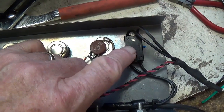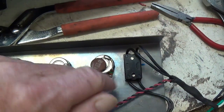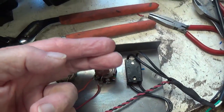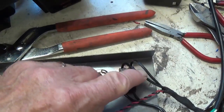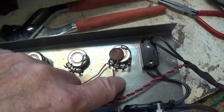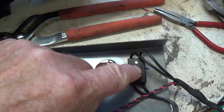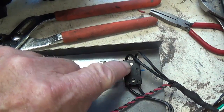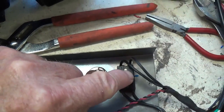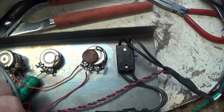And if yours isn't, then what you think is the white wire that is the return is going to become the hot wire because of the reversal within the receptacle on your wall. And the hot wire is going to be going hardwired into the power transformer primary. Not a good setup. Okay, so to be sure that regardless of the wiring of the wall outlet, your amp is completely off when the switch is off, use a single throw, double pole power switch.